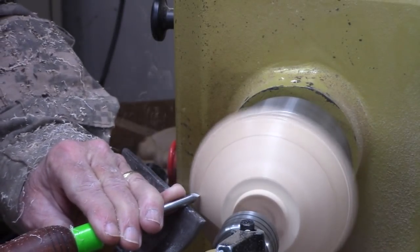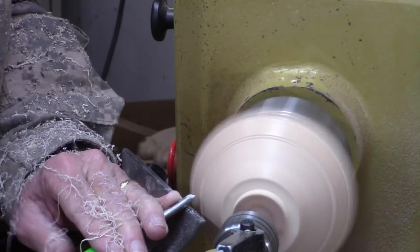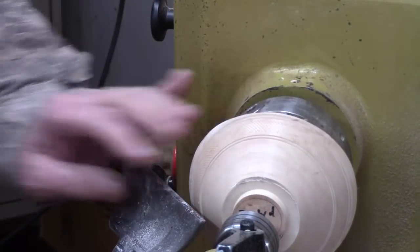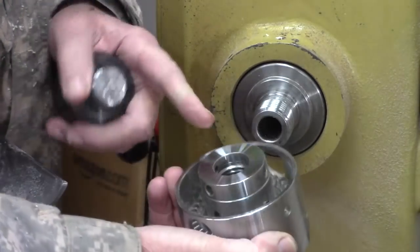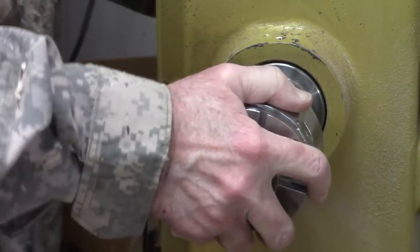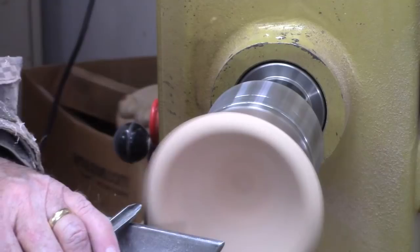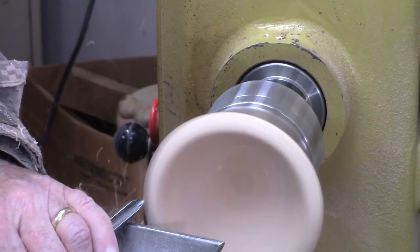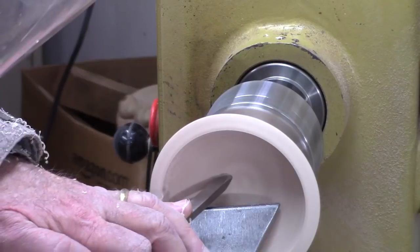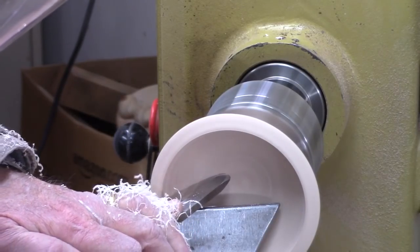And then right here, and then right next to it — turn that into a fine little bead. It tends to be a nice little detail having that bead. Now I'm switching to a chuck with a smaller set of jaws because it's got a thread for one inch — I'm using a threaded adapter, which is very convenient. It's easier to use a threading adapter than changing the insert. Now we're going ahead and screwing this on my Record Power SC3 chuck. You can see how out of round the rim is from that ghost image. I'm cleaning it up with a three-eighths inch bowl gouge. I've gone ahead and cleaned up the inside of the bowl. This video is not on making a bowl, but I'm showing you using a scraper to clean up some of the ripples inside.